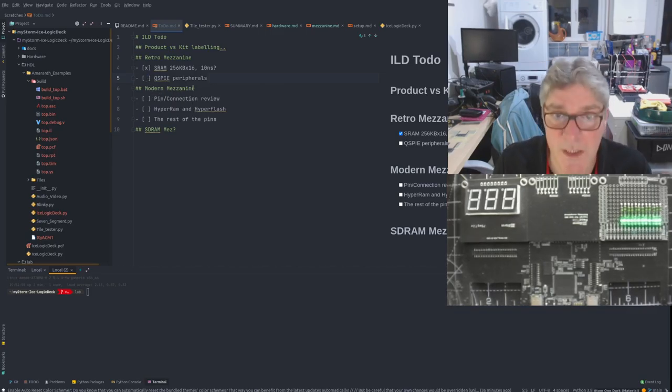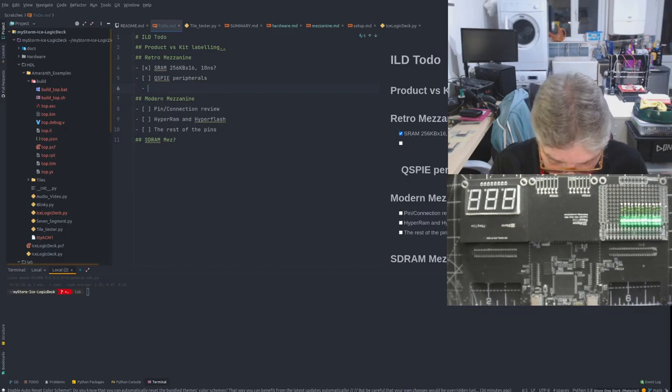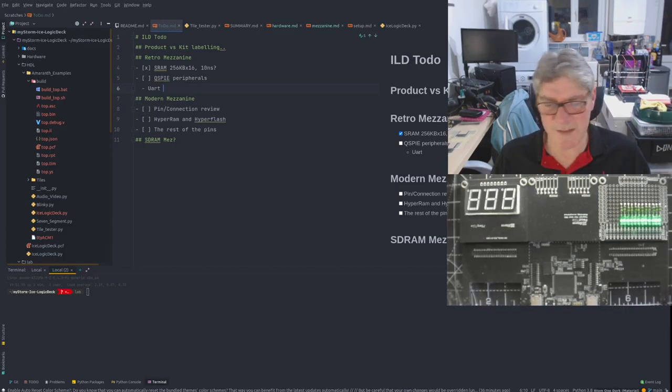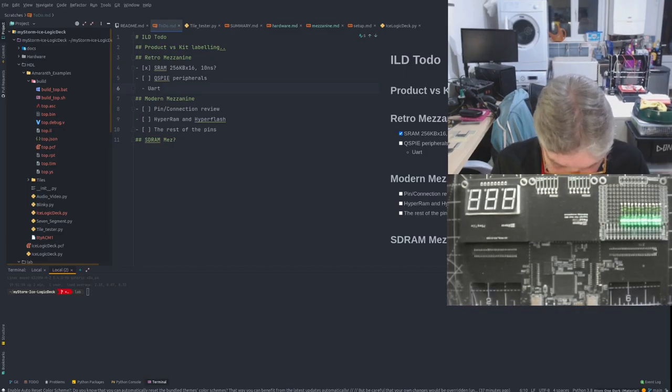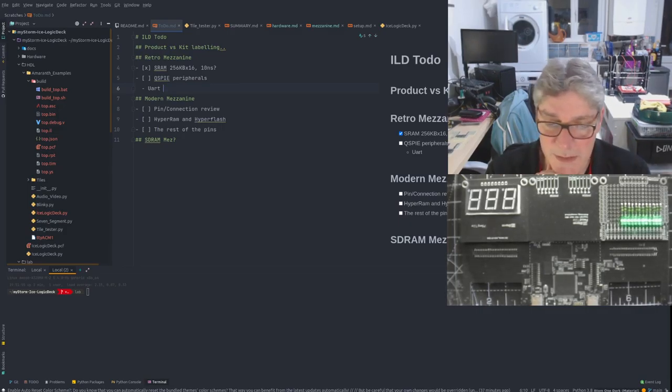Now, the obvious thing we could run over this, which I've just mentioned, is our UART. The advantage of running the UART over that is it makes the HDL for the UART theoretically simpler, because it doesn't have to worry about baud rates and that kind of stuff, and there's plenty of bandwidth there. And then at the other end, the STM32 still chucks it up the UART as a normal USB CDC COM serial. So from the host end, it looks the same.